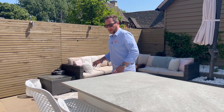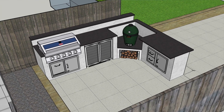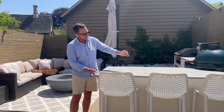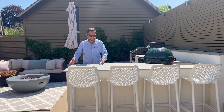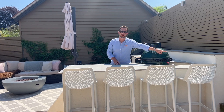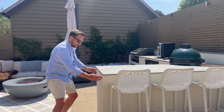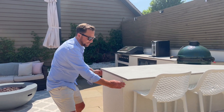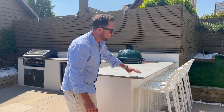It's worth noting that when designing this kitchen — and if you're thinking of designing one yourself — the measurement of this L-section I actually did with these slabs in mind so that we didn't have to cut any of them. We could have full slab all the way along, and the only cut was on the end there. You'll also notice we've got an overhang here creating a bar area. We built that section to about 600 to 700mm so you could have that overhang without having to cut any tiles — so all the edges are the machined edges that the tiles came with.